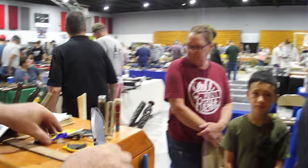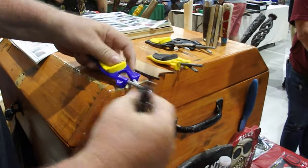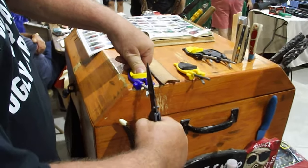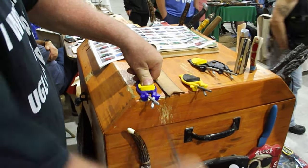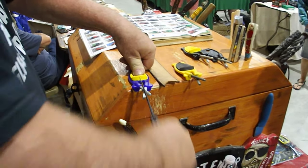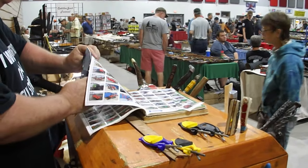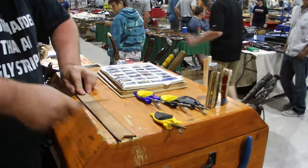Now on the smooth edge, they got a patented flex. Them are honing steels. Squeeze your blade in there tight. When you draw through, you can only make them sharper. They're made to follow the original edge. Takes the guesswork out of sharpening, and puts the original edge back in any style knife. Hit it off on a piece of leather when you're done, and that'll polish that edge.